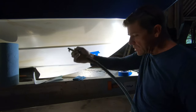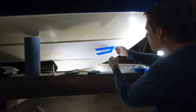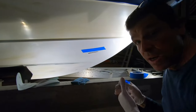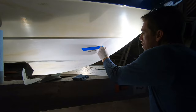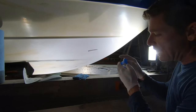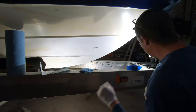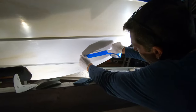After blowing out the surface, I'm going to re-tape this — pull off the blue tape we put on there and move the border back just a little bit. There's not an exact science and there's not just one perfect way to do it. You just want to be sure you've got a good clean surface and that you're not damaging any gel coat out beyond the repair area.